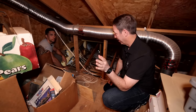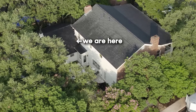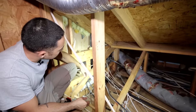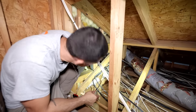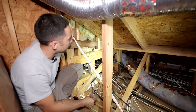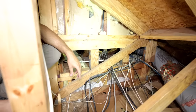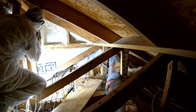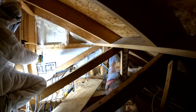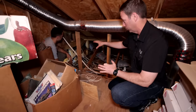We also found something important in the garage attic. In two-story structures you often have a knee wall in the garage space. In this house it's actually open to the mid-floor — a complete air highway for leakage. This is a super highway of air leaks. They had old batts on there, so we pulled those out and we'll hit it with two-inch closed cell spray foam to create a continuous thermal and vapor boundary with a good air seal.